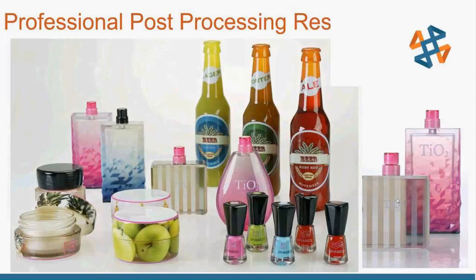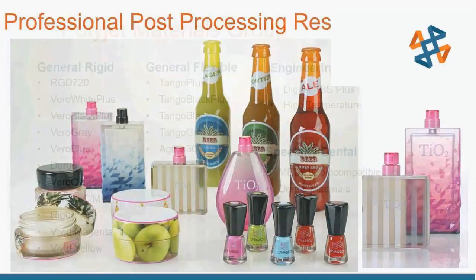But if you're down and dirty into the FDM world, that just needs to be representative of an injection mold, you can get away with the three-step process. You don't need the eight-step process. Note the difference between the 3 and the 4-step with a hard geometry: you're talking about 2 minutes per square inch versus 11 or 12 minutes per square inch. Then if you want to double that into the different grits, now you're talking about 20-something, 30 minutes per square inch to get these geometries done, to polish like this. So it's a judgment call on your part on how well you want these things to look.